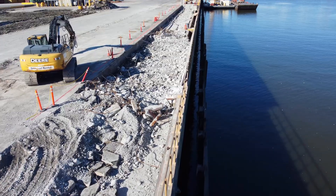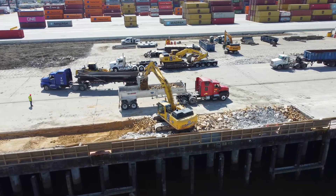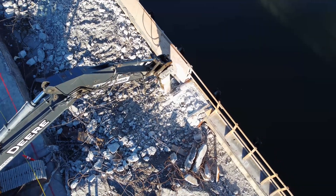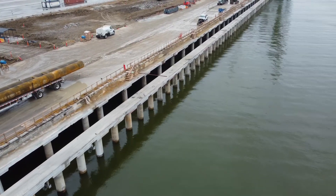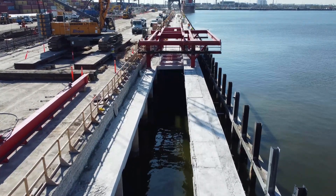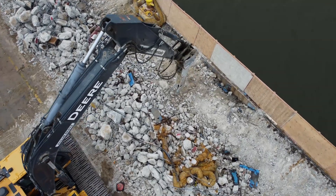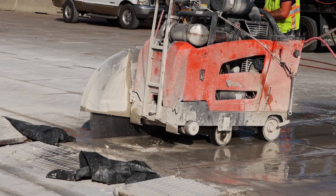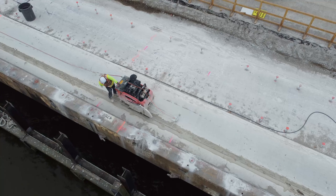The next demo step is where complications begin. On the waterside, a strip of pavement for the new line of piles needs to be opened. After the sacrificial deck is removed, the structural deck needs to get demolished. However, one line of existing columns will remain in place at the very front of the wharf. It gets even more complicated because of the water – an excavator with a jackhammer cannot simply demolish the structural deck, as the demolished concrete would fall into deep water. We need to work around this problem: the structural deck will be saw-cut, and then pieces of pavement will be lifted with a crane like big blocks and moved out of the way.